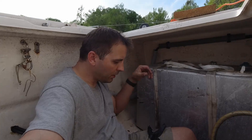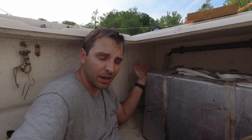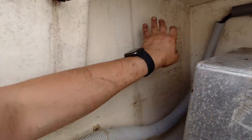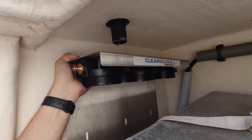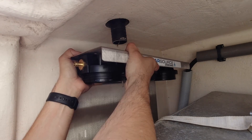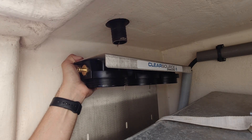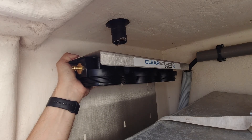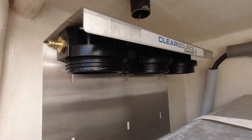I've got this pretty well cleared out. I've got some more work to do, but at this point I'm going to take a moment and scrub things out — I'll spare you watching me scrub. Basically this is where I want to put the water filter right here. I've made a lot of progress getting everything clean — it's so much better now. The filter housing is actually very heavy — looks like 18 or maybe 16 gauge stainless. I'm going to mark the holes, start with the center one, get a bolt in there, get it level, and then mark and drill my other holes. I've got one bolt in right in the center and I'm going to check with a level to make sure we're level.